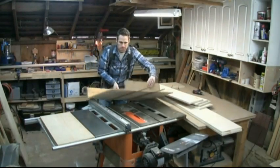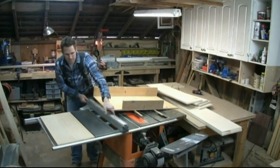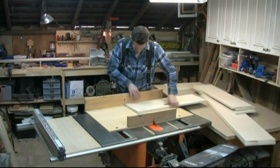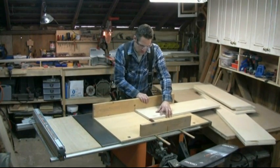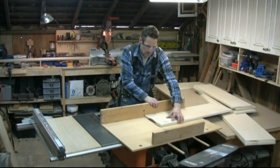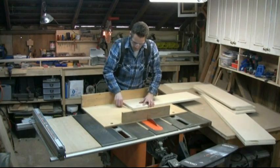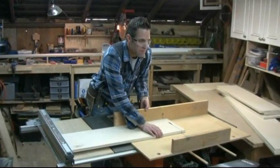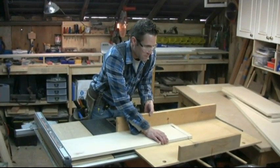Time to show you my favorite homemade woodworking jig — the cross cut sled. It allows you to cross cut longer material safely. You need support. Don't try to do this freehand. You get a much more accurate cut with a simple little jig like this. Cross cut sleds are great. You can use them over and over again and they're cheap to make.